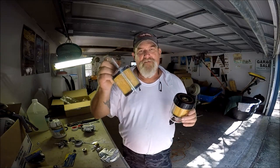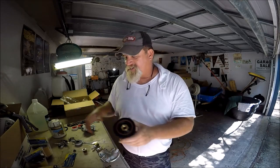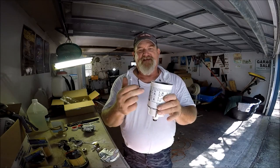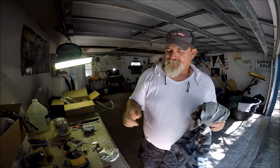He's putting it on his boat and I'm putting it on my boat. I want to see the water that collects and be able to easily change out the filter. I always carried a spare Raycor on the boat anyway. The other day I unspun the Raycor and everything got stuck - it took me and two other guys, thank God I had some real men on the boat, to get the bowl off. We had to smash a hole through it, just all kinds of stuff. The MARPAC looks like it's a whole lot easier to use.